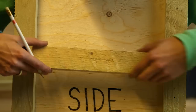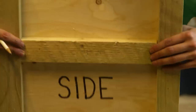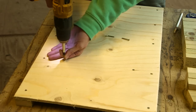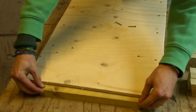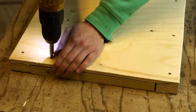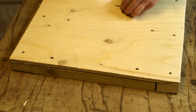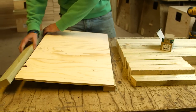The next batten is 15 centimeters down from the top — that helps to support the exercise platform which will go on at the end. This batten is cut at angles at the ends; it's going to be attached to the lid and will stop the lid sliding off. These are temporary screws that will just hold this piece in place for the time being. Now just repeat the same process to create the other side.